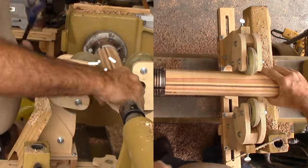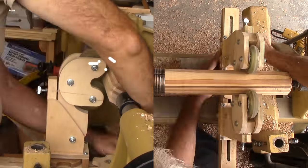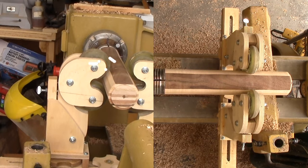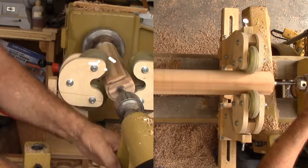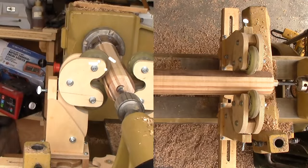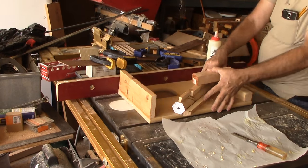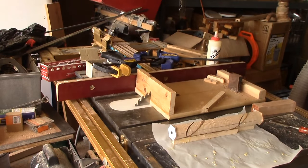Since I want separate handles from the pin, it is time to drill the ends. However, for something this long from the spindle, I'm going to use my steady rest to support the rolling pin during the drilling. With the steady rest, the cylinder is as steady as it could ever be. Now for cut number two — I've reinforced the cylinder, inserted a spacer, and make the cut, then glue in the slice.